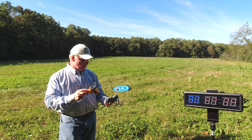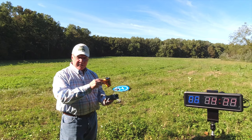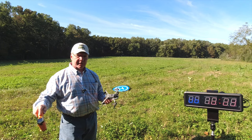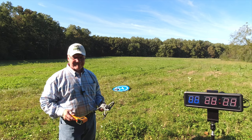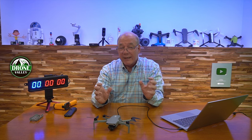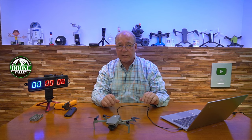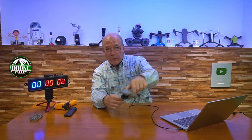I'm heading back to the shop for the bench test — what about transferring files or doing a firmware update where it's sitting completely still with no wind? My suspicion is that will be the worst case, hovering the next worst, and flying the least impactful on heat. Back at the shop: I had obstacle avoidance turned on and was recording 4K footage at 200 megabits per second for both flight tests — all bells and whistles on to make it as hot as possible. The hover test averaged around 119 to 120 degrees Fahrenheit at the heat sink, and the flying test came in about 20 degrees cooler at around 102 to 105 degrees.